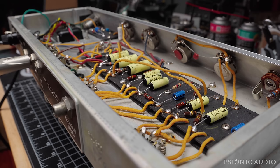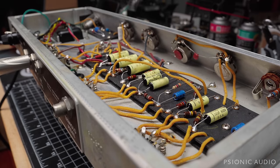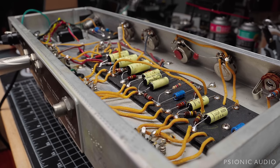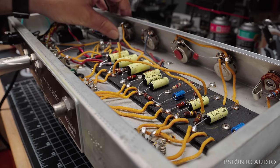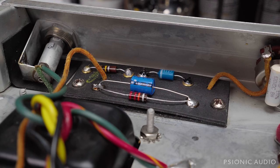Everything cleaned up very well inside. I had all the solder out, really cleaned the board, and put everything back together much more properly and neatly. The caps are all nicely oriented as much as possible — I can't add length where they were trimmed before, but it looks much better. Aside from one resistor on that cathode waiting on the next order, they're all carbon comps except for the two 1-watt positions, which are actually 2-watt resistors now — better than the old 1-watt carbon composites. This looks a lot more period correct and has no DC voltage leaking anywhere. We're going to get a matching Jupiter just for this cap in the tremolo. I'm very pleased with how everything's coming together.